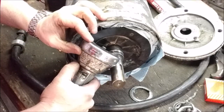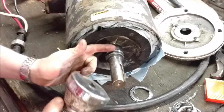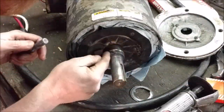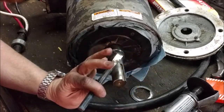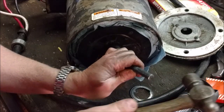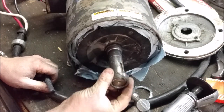I'm going to put a slit right across the inner race with the die grinder — you kind of have to go at an angle. You don't have to go all the way through, because the steel in these bearings is extremely hard and extremely brittle. So I've got my cold chisel, I'll get it in that crack, and we're just going to wedge it open. There — it split right open, and it slides right on and off like nothing.